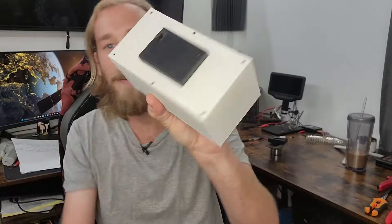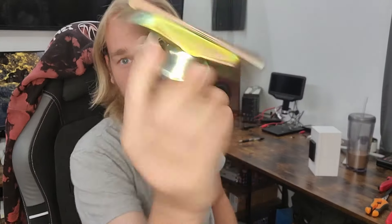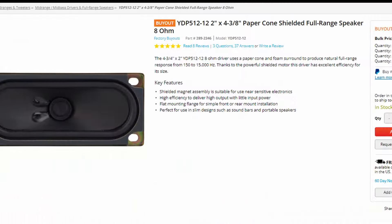What's up everybody? My name is Joey, this is Eclectics Workshop, and today I'm going to show you how I built this 3D printed Bluetooth speaker for less than $25 using this MHM38 Bluetooth amp board, this AA battery pack with an on-off switch at 4.5 volts total, and this speaker driver from Parts Express. It's full range and costs less than a dollar.